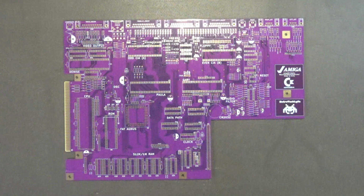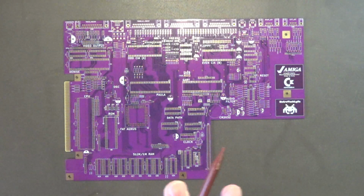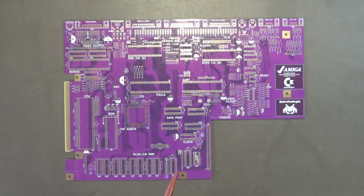And I actually remember reading online somewhere that the machined sockets are not designed for integrated circuits. And if you use them for integrated circuits, the mean time between failure rating is only 10. Yes, you heard me right. 10. In other words, you could plug an IC in and out 10 times before the IC leads wear off enough of the inside of those machined holes to where they no longer make a good contact with the leads of the ICs. This is from several of the manufacturers.